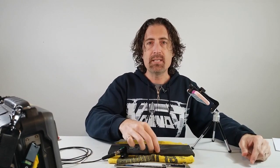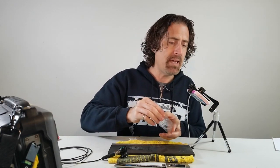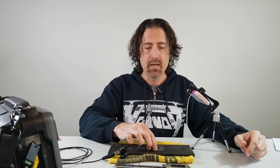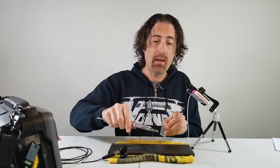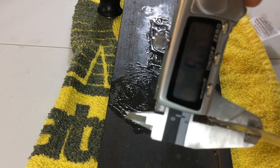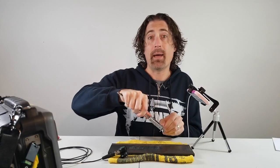This little piece of plastic is probably polyethylene terephthalate, or PET. The velocity of sound through this is about 1900 meters per second, which is about a third of what it is through steel. So if I had a difference of 1.5 millimeters and I divide that by three, I should get about the thickness of this thing — about 0.5. We'll measure this and we get about 0.6. Not bad.